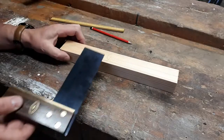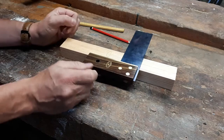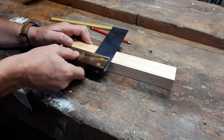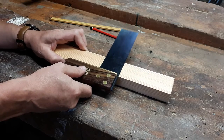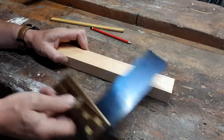And that's a reference point, face side, face edge, and we use our tri-square always with the brass strip touching either face side or face edge whenever we want to use this to mark lines which are 90 degrees to the edge of the wood. So marking lines are perpendicular, and the term that's often used for this is to square lines onto the wood. So we'll be looking at how we use that in the next video.